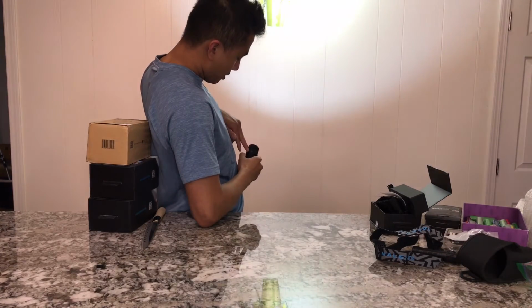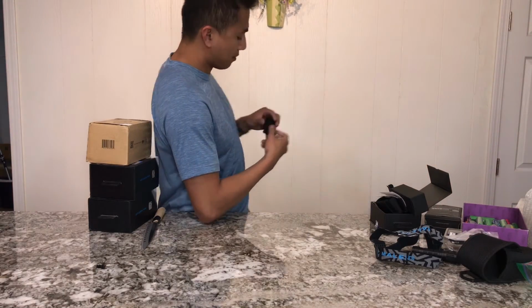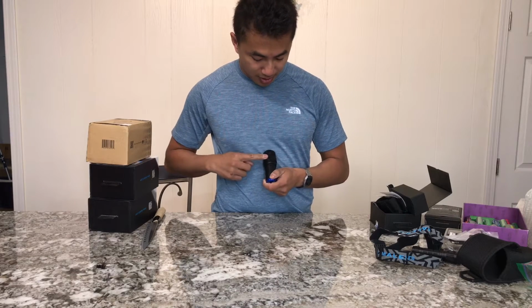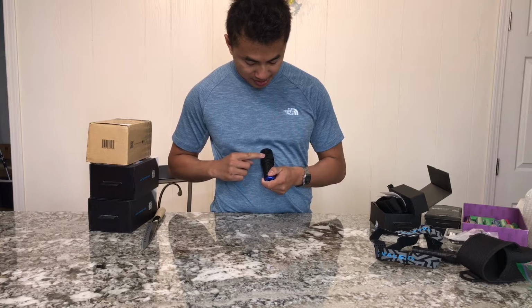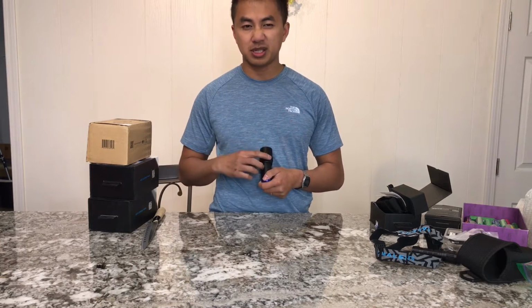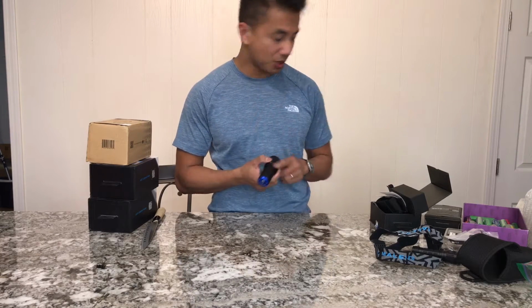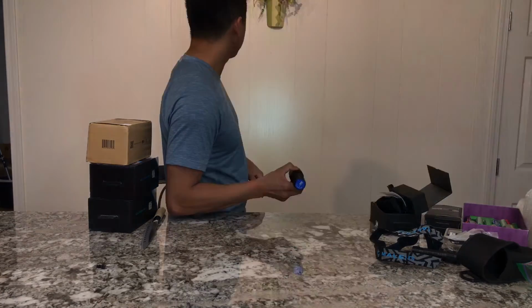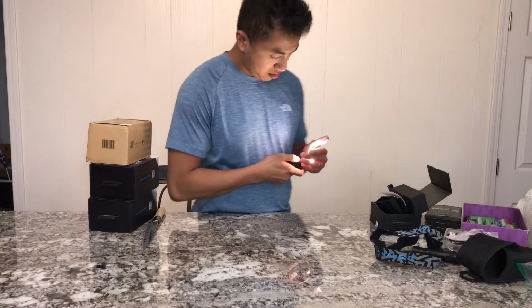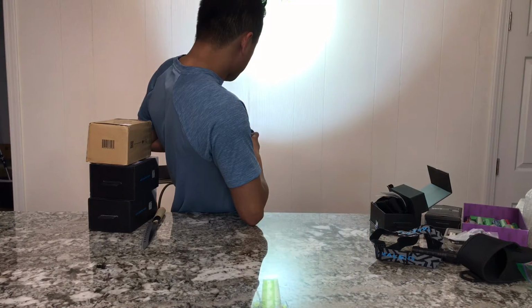And on the screen it says 3,800 lumen. And then the button on the right side will turn it on and off. So it's okay, the UI is alright. Instant turbo by press and hold on the strobe button over here, the disco button, and then the power button on the right here turns it on and off. Every successive press alternates the level. There seem to be three different levels. Okay, 20 lumen, 300 lumen, 2500 lumen.